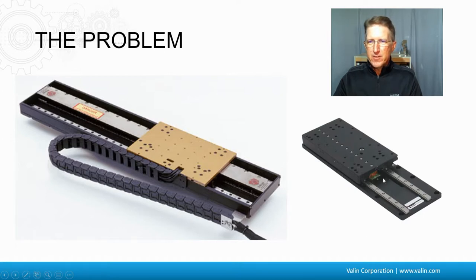Here is a different type of linear motor — it's an iron core. Again, the whole load is supported by these bearings, and it has a coil here with magnets underneath this carriage. If all that's supporting the load is these bearings, it slides very easily back and forth when it's horizontal. When the power is off, you can just run it up and down those bearings because nothing is stopping it. A ball screw — you can't do that; you have to really push against it.